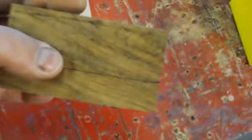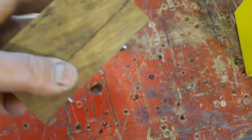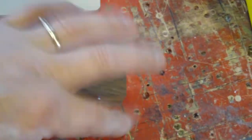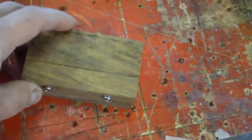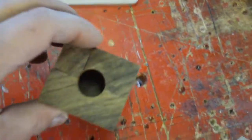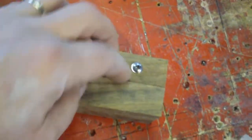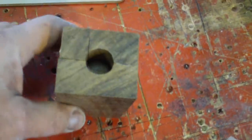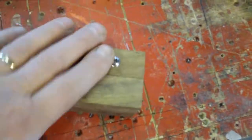This is the safest tool I've come up with, plus it's a beautiful tool, and this is your user interface. Why shouldn't your user interface be beautiful and fun to handle? I trace out a profile on it, cut it out on my bandsaw, sand it, route it, so it's a nice thing to hold and look at. It works properly and has an easily replaceable utility blade - take two screws off, put a new blade in or flip it over. You get two uses out of every blade.